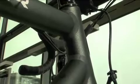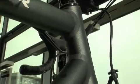The aluminium we are using here is a high-grade 7000 series aluminium, which is then heat treated and smooth welded. So the welds which you see actually here are smooth welded welds, so the frame is not having polished welds. That's why we're also showing it here with a gunmetal anodization, and underneath it is sandblasted, but not with sand, with glass beads. Okay, so it's not a gloss finish, it's a completely different finish, quite unique to Storck.